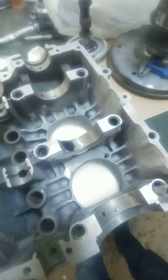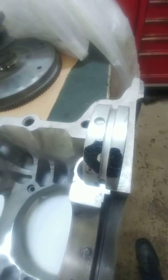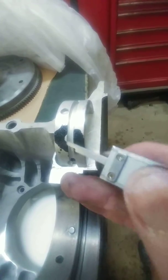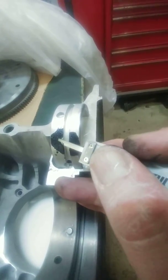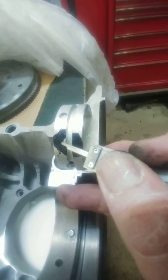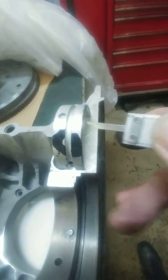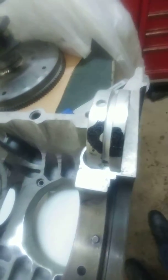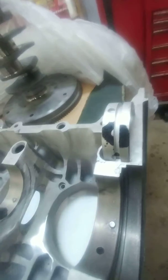It left a little bit of a different mark than I was hoping, but you can see right here - I'll just use the end of my vernier to show you - that the hole is at least half covered. That's going to restrict the amount of oil coming to that bearing, and I want as much going to that bearing as possible to be able to absorb the heat, carry it away, and take it to the sump.